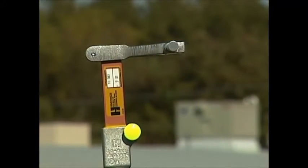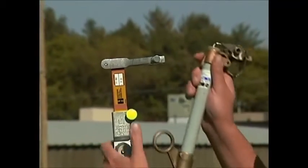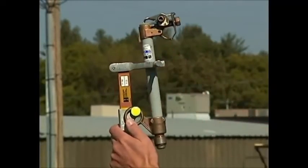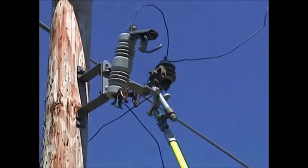Once you have your new fuse installed in your fuse barrel, take the eye of your line fuse barrel, put it over your green tab, push the top of the barrel in place, and you're ready to take your fuse barrel up to the line fuse. You can see as the line fuse goes up, it's held securely in place by the fuse claw.